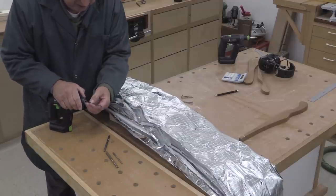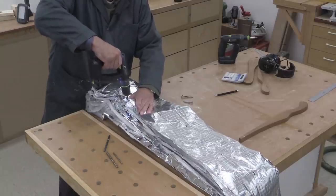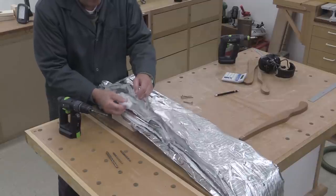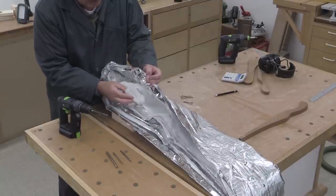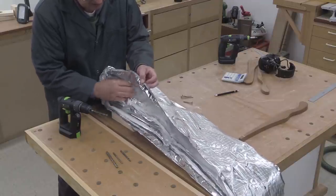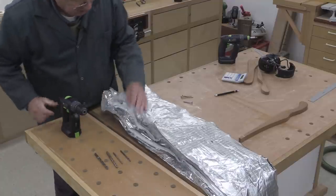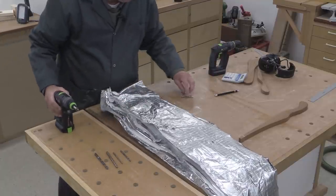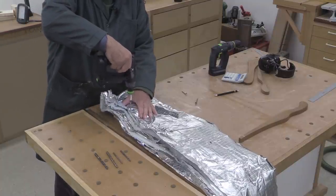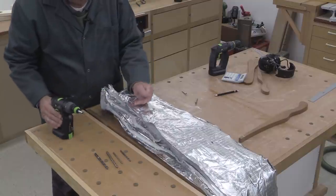Let's try it with the two ordinary bits. Not quite as dramatic, but it does catch — I could see it catching. If you look here, you can see how this fibrous layer has been caught up, and it's that which is causing the problem. So, you can't drill through this just in the ordinary way. Let me check to see if putting a screw in is a problem — a large screw. No, large screws are not an issue.